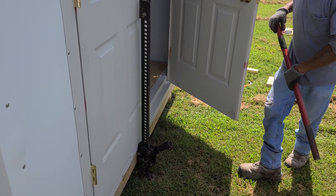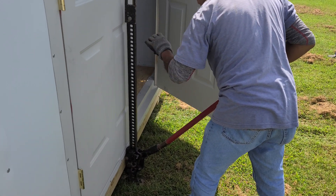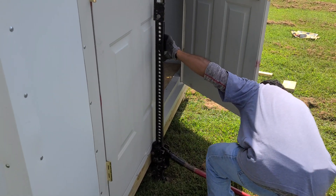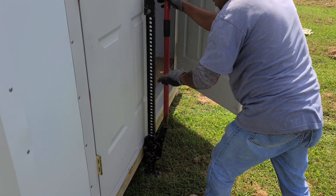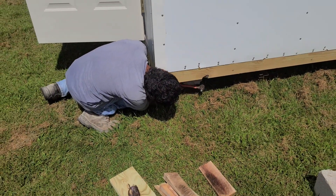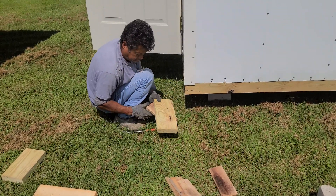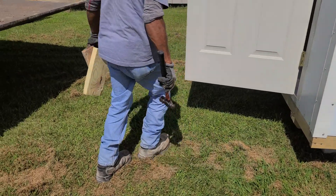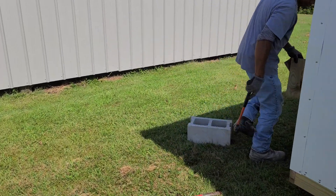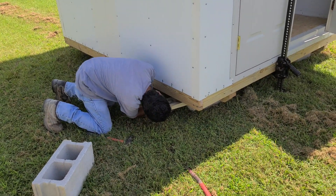The original pins in the hinges, since they're outside-facing, you could have just tapped them out with a screwdriver and a hammer. The pins they put in are actually manufactured so you can't tap them out, at least not easily, so that adds additional security. We'll also add some additional security to the door that we don't open as often, so that it would be much harder to kick in. Here you can see our fellow inserting some additional boards for leveling. He's got a level on the inside of the shed for both front-to-back and left-to-right leveling, and all he has to do is insert pieces of wood to get it as level as needed. This is a temporary location.